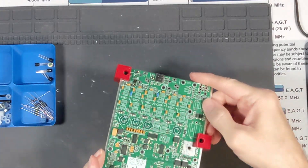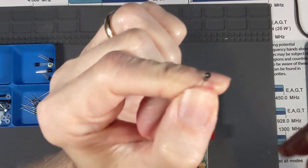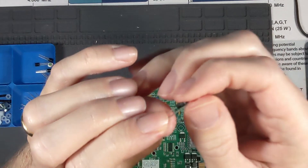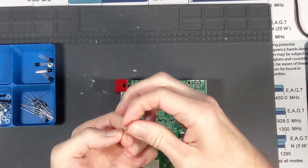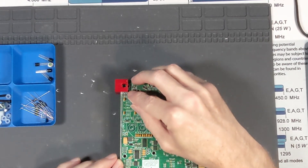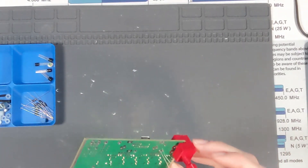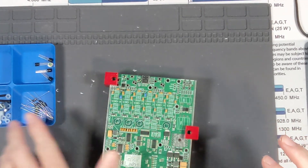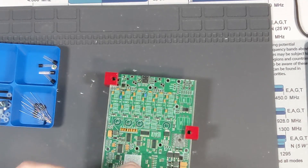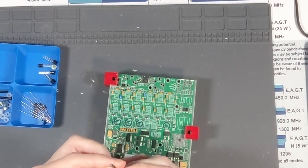What I'm going to do is bend the striped end flush with the top of the diode body, and then flush with the long side — that makes it fit perfectly in the holes. Then the bent-over end, the side coming out of the stripe, is going to go to the left. I think I'll go ahead and form these first six and get them all in there and solder them all at once.